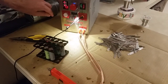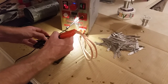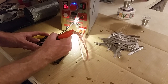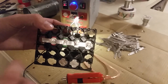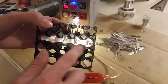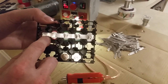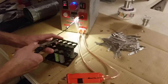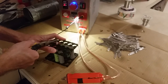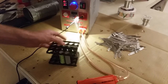I can probably turn these settings down quite a bit. A pulse of 8 might be better. If you look here, you can see the difference — there's a little bit of black where the 12-pulse setting burnt through the nickel. With the pulse of 8, you can see the indents but they're not as black and charred. Even the pulse of 8 weld doesn't come off when I pull with the pliers. So I can probably use a much slower pulse than what I'm using, but you get the point.